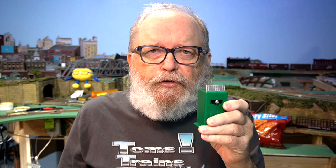This channel was created to help other modelers who are in need of guidance in pursuing their dream of building a model railroad. We're going to take a look at the tortoise switch machine and this end card right here. It has eight terminals on it — power goes to the motor on the end ones, and there are two single pole double throw switches on the inside with three terminals each. We're going to use three of those terminals to power the frog from the two rails.